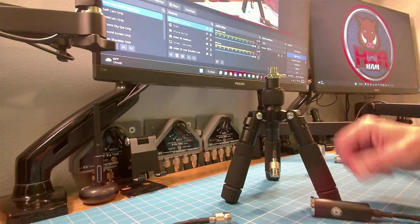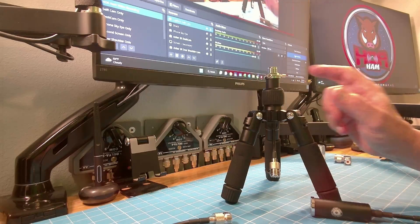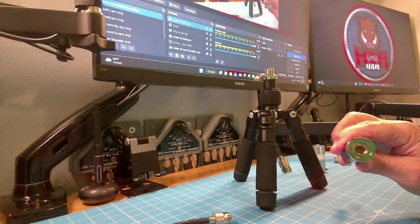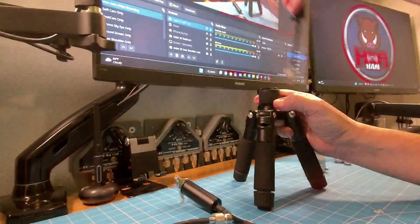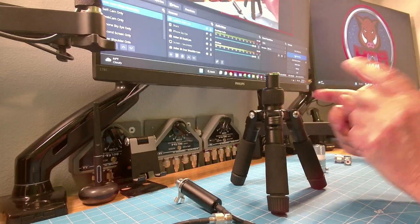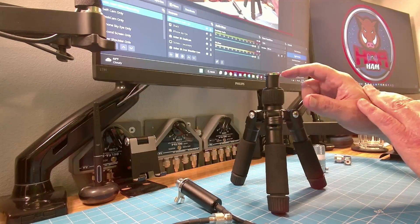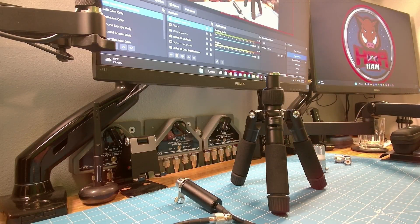Gable has solved the problem. They've given us two posts — an SO-239 to use with their antenna system, the toy box, and any other antenna system that requires that connection, but most of us are used to our 3/8 by 24 and that's what we expect. So we remove the existing post and add our 3/8 by 24. Now any antenna that has a 3/8 by 24 male thread can automatically go into this antenna system. The first thing I was wondering when I saw this was how in the world did they pull this off? This is a radiating part of the element — this piece of metal right here — connected to this post. What did they do? I must admit I have no idea.